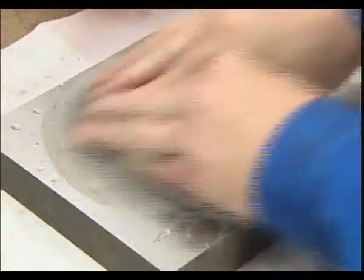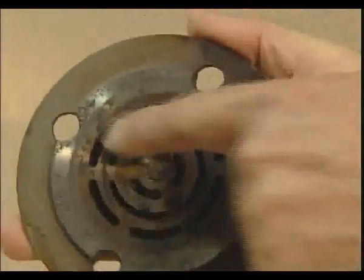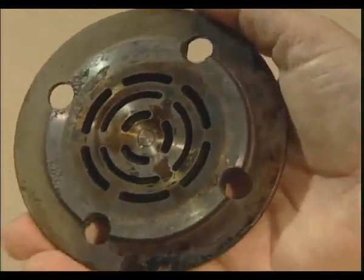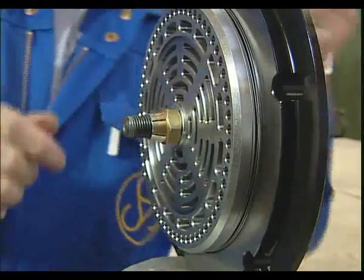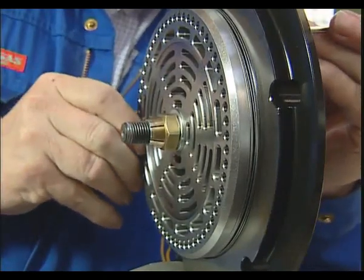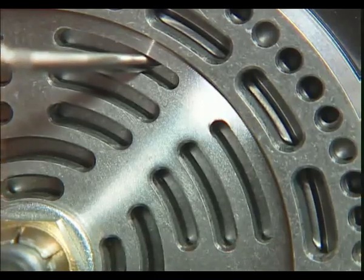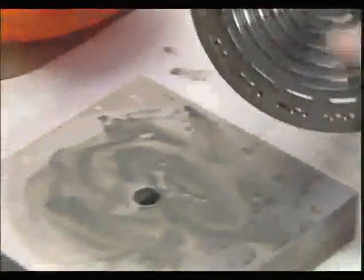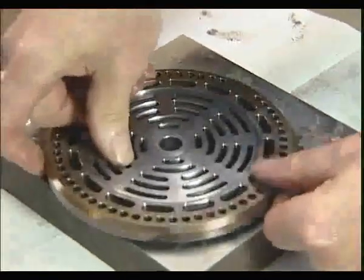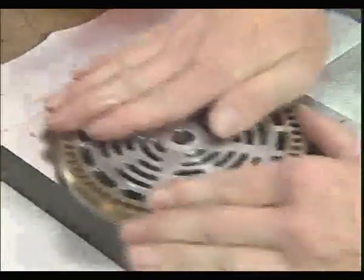Cleaning and then lapping the surface can remove any build-up and minor damage to the sealing surface of the valve body. We recommend replacing severely marked or damaged internal parts. Installation of the internal valve parts must be performed with special care and attention for their location. After the assembly of the valve, check the functionality with the help of a rounded pin for free plate movement against the springs. Please pay attention to the repair of valves on board. Any repair may require machining skills, which again may not be readily available. As an alternative, the Sauer service offers an attractive valve exchange service.